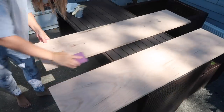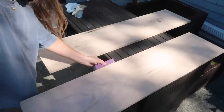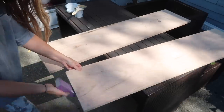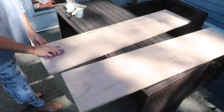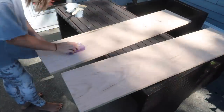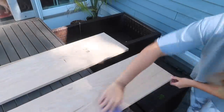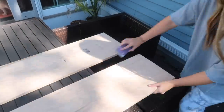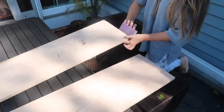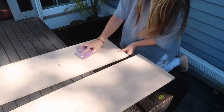For this space, I'm going to be making my own shelves that will essentially hold all of the laundry room supplies and also some minimal decor. I'm prepping the wood with a sanding block just to get rid of any of the sharp edges. I had Home Depot cut these down to 48 inches each, which was the exact size of the previous shelves. And being that they were cut, the edges were a little rough and raw, so this was a necessary step. Once the sanding is done, I'll quickly wipe them down to get rid of any dirt so I can apply the stain.